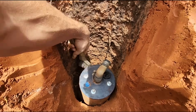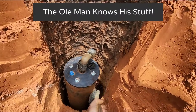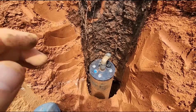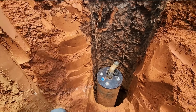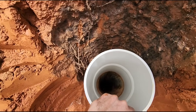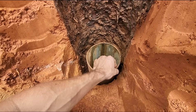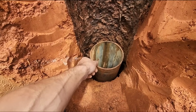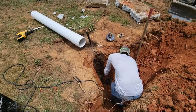You know what happened — they couldn't get the casing down, they couldn't get it in, so they went in and cleaned it out. They didn't have anything back then to put the metal on, so they rested it on top. That's all they had back in the late 80s — this well was drilled around '91 or late 80s; it'll say it on the tag. It's got too much of a lip right now — I'm going to have to grind that off. I can feel there's definitely a wedged-out lip here. It goes on the inside and the outside because they cut it with the casing cutter and then it fell. I can grind that — just that outside lip.